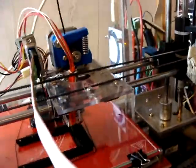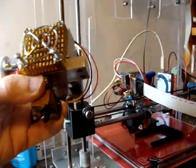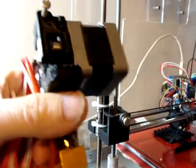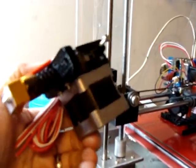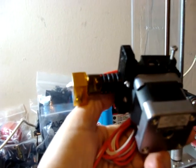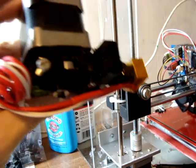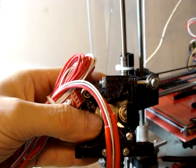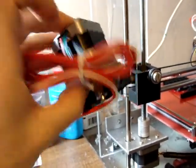Coming up soon: I have my third extruder. We're using extruder 2 — the blue extruder with the all-metal hot end. The original extruder was all metal, all together, $55 on eBay — and you get what you pay for. Here is extruder number 3: it uses a printed extruder connector, and the hot end is Teflon or PTFE. The hold-up on this is getting the right bearing — the current one is too small, and a 608 bearing is too big, so I need to find something in the middle. As soon as I get the right bearing, it should be ready to go.